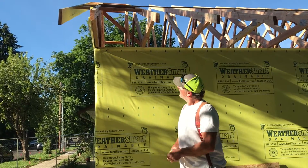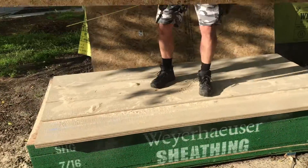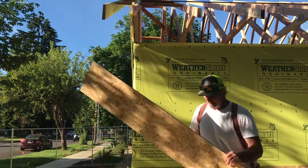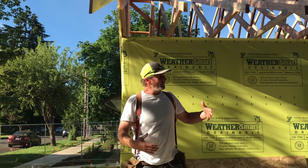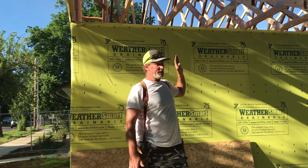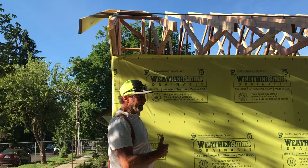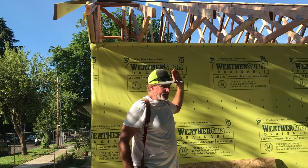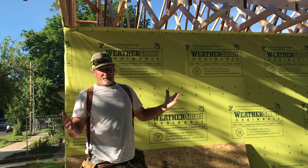But that's not really what I want. I want this overhanging plywood — the stuff I'm standing on — to go from the outside of the building to the middle of this truss, and then the other roof sheets we put on will go to the middle of this gable truss. Long story longer, I pulled from this side and went 24, then 48, 60, 72 — everything is set away. So I'll be able to start with full, uncut sheets: a full eight-foot sheet, then a four-foot, eight, four, eight, four. When I get to the other end I'll only have to take an inch and a half off, so I don't have to cut both ends.